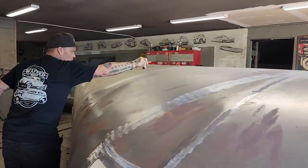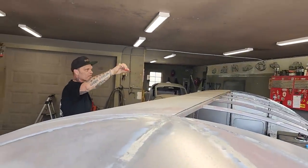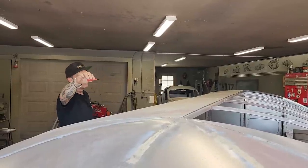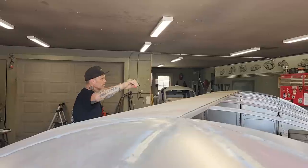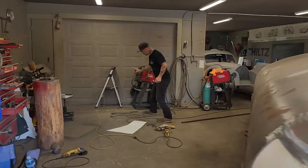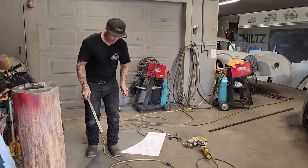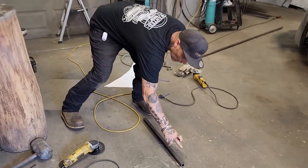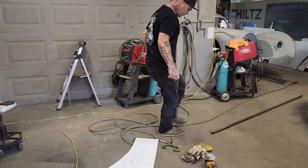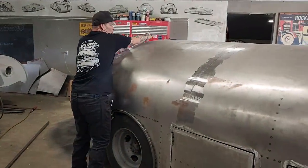Where it welds all the way along there, I have a rib every 2 feet, and when I weld it down there, I'm thinking that you're going to see a little bit of weebly wobbly going along the center down there, just a little bit. But in all honesty, in order to make that perfectly straight, this is what I'm going to do. I can buy 1 inch by 3, so if I stack that three high, I can get 3 inches high. If I build my fin out of the 1 inch, I can take 1 by 3 and run it from this point right to the front